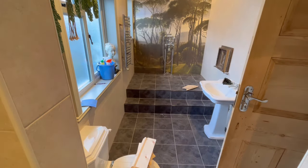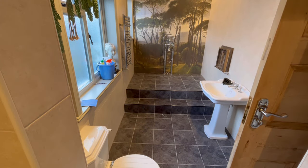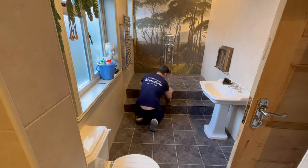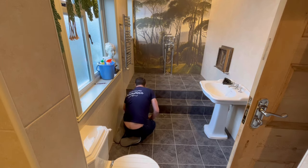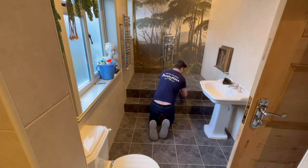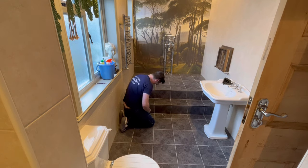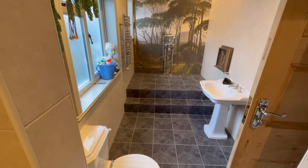If you study the lower left-hand side of the screen, you will see that my wall tiles have a thin plastic strip running through the outward corners, which makes for a nice clean connection in tiling. The floor tiles on the two steps have the same thing in black. I've decided to give the plastic a light key sand ahead of my primer coat.